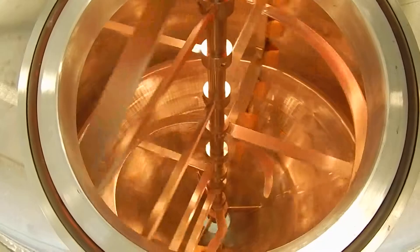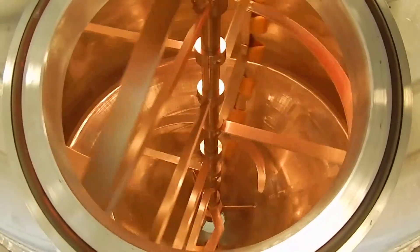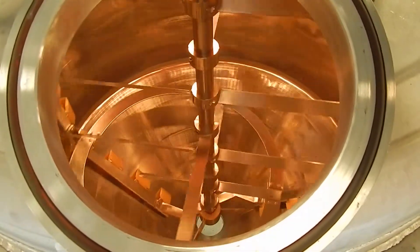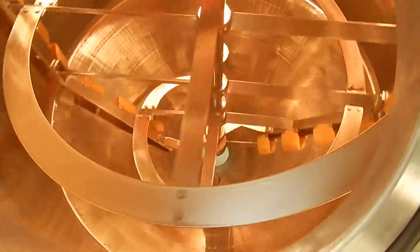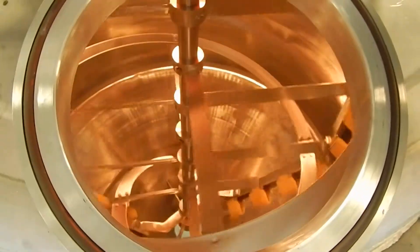The scrape agitation system features nylon scrapers hinged all around the perimeter, and of course you'll see there's an upturning ribbon so as the unit rotates clockwise the ribbon turns upward, helping in the mixing. A little bit of color left in there is from another form of process.